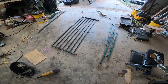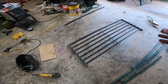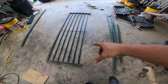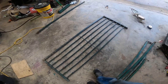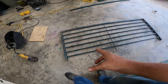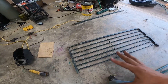I'm kind of thinking as I go, but I'm going to do two feet wide. I cut the dog cage down - it's two feet wide and roughly five feet two long. I'm going to weld a square piece of tubing on the back side and put some braces in the middle too, because the round tube is kind of flimsy and I don't think it would support the weight of the wood. I'll weld square tubing underneath maybe every foot or foot and a half, then put some six-inch legs on it.